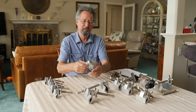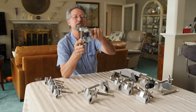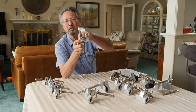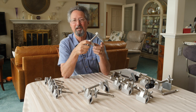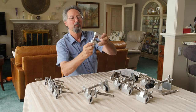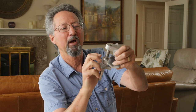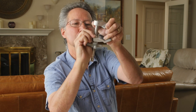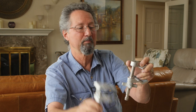Jamming has always been a concern — it's inherent in the design that your resistance is over here and your force is over here. We've gotten better over the years so they jam less now, but occasionally they will. If that happens, the best way to free it up is to loosen the knob a few threads and then grab the back end of the jaw and pull down — that will release it. If it doesn't, hit it with a crescent wrench or the back of another clamp and it'll free right up.